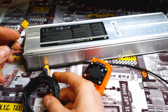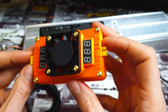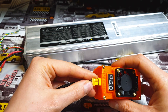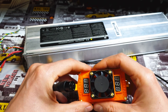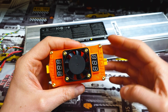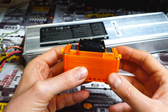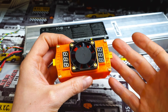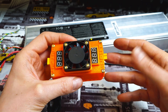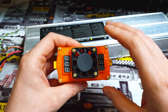You can create any kind of adapter you would like to use, because here we've got XT30 connectors, and here is my adapter for something like the Boeda ES18. Just connect it over here and you can charge it. But like I said, the maximum output voltage is 50V, so this is good for Fido e-bikes with a 10S battery or for the Xiaomi M365. Because this thing is quite small, you can use just a simple USB PD charger to charge your notebook and smartphone — you don't have to carry many different chargers. You just need one charger to charge everything.